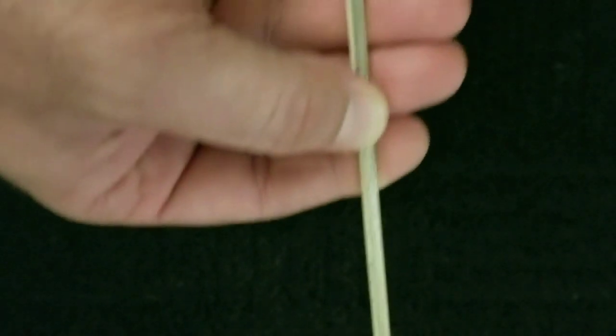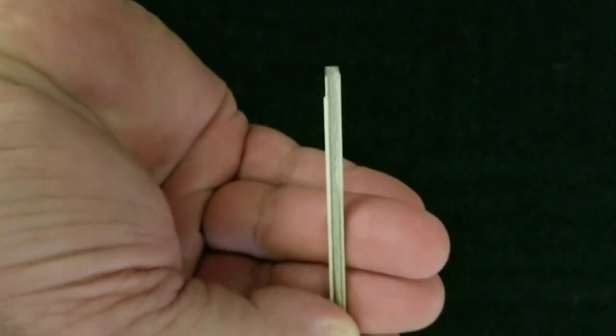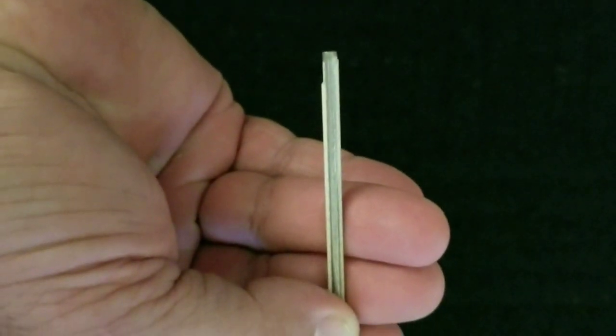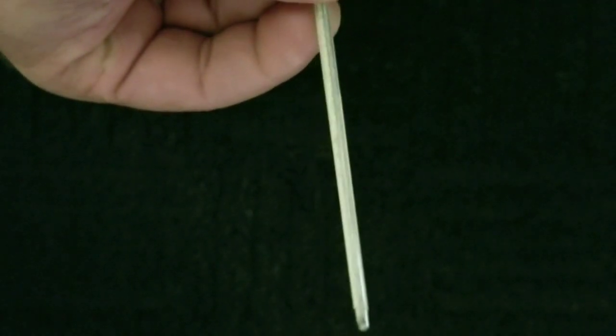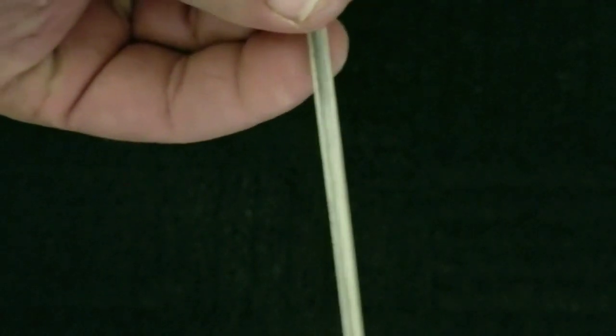But if you're magically challenged, just take your pocket knife and scrape off all the flux on one side. The reason we do that is because it's hard to see the puddle on the side that's facing up towards the gas. As you can see, we've got a real narrow gap, about 3/32.